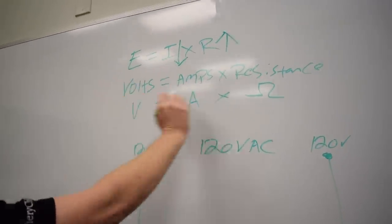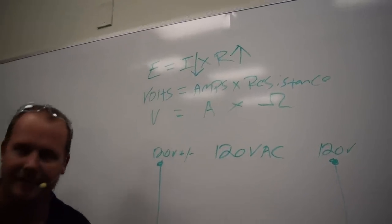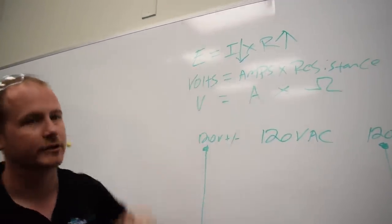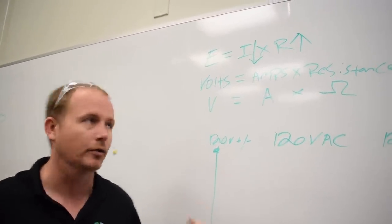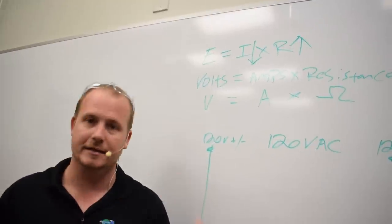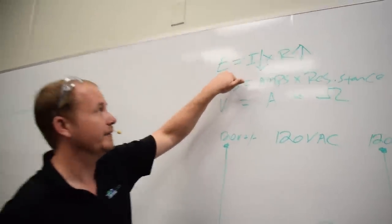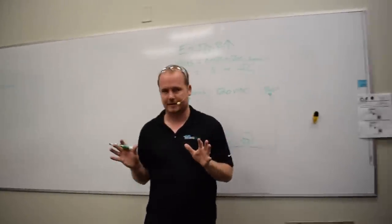Now, in the electrical circuit, the thing that primarily stays constant, at least in our minds, it doesn't really stay constant, we're going to get into that, but the thing that we think of as staying constant is the voltage. If you have an outlet, you say, well, that is 120 volts or 115 volts. If you have a typical residential air conditioner, you're going to say it's 240 volts. And so you expect this to stay fixed. I'm going to show you how, in reality, that doesn't always stay fixed.